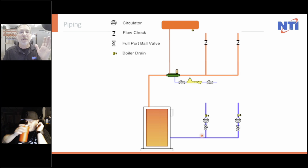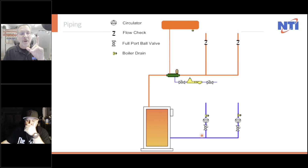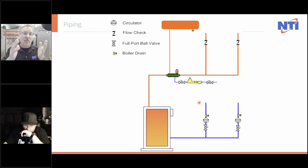We can go through why we started doing this in a whole other session, or I'm going to make a suggestion to buy a book called Pumping Away by Dan Holohan. Best way ever. But here's the problem. We replaced these huge boilers that used to be coal-fired, like what's in the basement of Jason's house, this huge cast iron boiler, and we put in these little teeny weeny cast iron boilers, but we still had all this water out in the system.